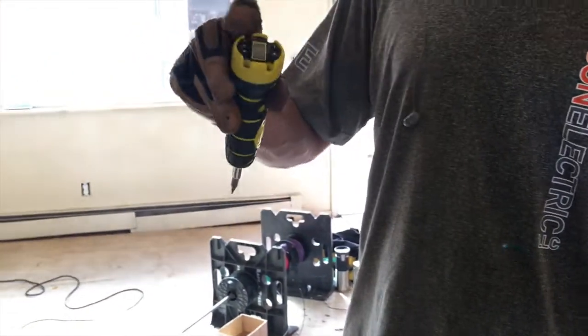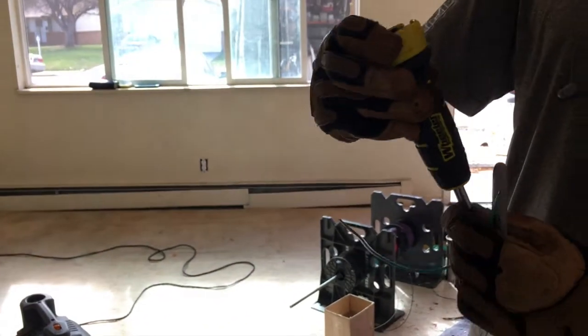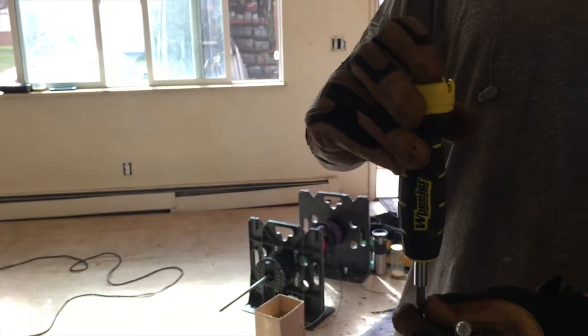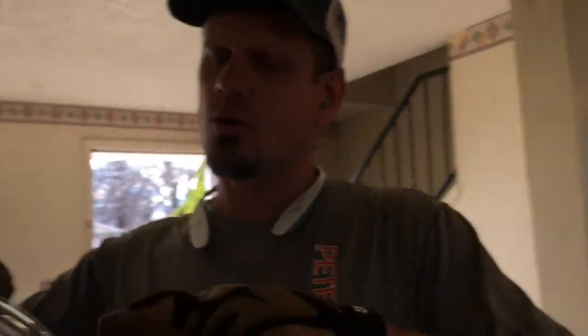In this city that I'm working in they don't require it — they really don't require permits on plugs and switches whatsoever. But keep in mind, guys, when you're doing your aluminum pig-tail copper splicing, you have to use a torque screwdriver. You can calibrate it, pick your inch-pounds, and as you twist it, it beeps and tells you when to stop. I do that in every single two-port and three-port connection. Of course, if you use twist caps, they don't have that.